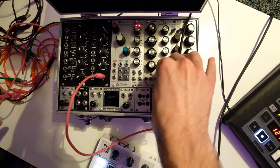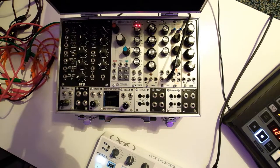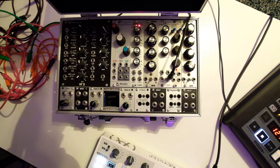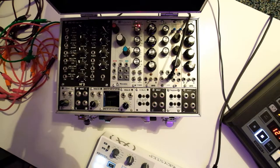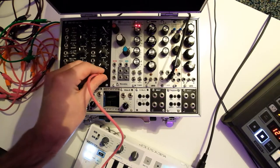So, this is when our envelope generators come into play. The envelope generator basically is going to take our gate signal. The gate signal is a voltage signal that can be open or closed, but the envelope generator is also going to shape it, and it's actually going to tell the VCA when to stop according to the notes we send to the VCO.